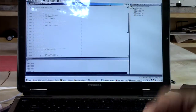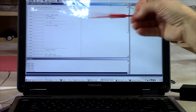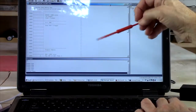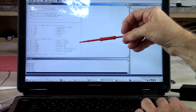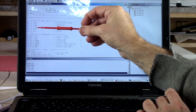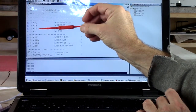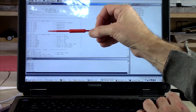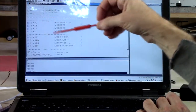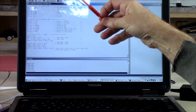And you can see, or not, depending on how the screen looks, in here that I've laid out as a comment the memory map. And then we have our input pins defined. Pin 2 is read-write. Pins 3 through 6 are A15 through A12, A15 being the high-order bit. So there are the high 4 address bits. I had a couple of extra input pins, so I put the clock signals in there, although I don't use them. But I'm thinking, well, maybe I'll figure out a use for them somewhere, somehow.